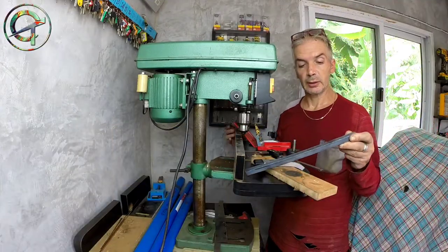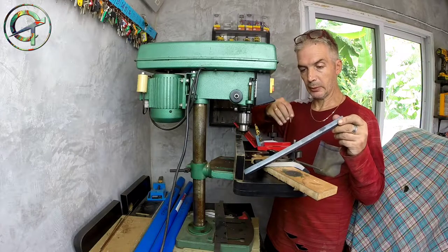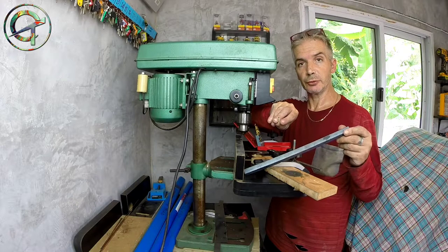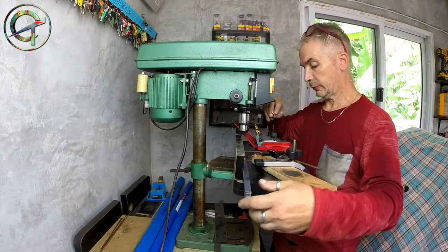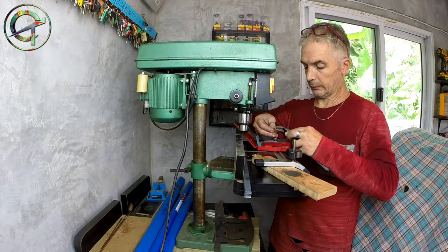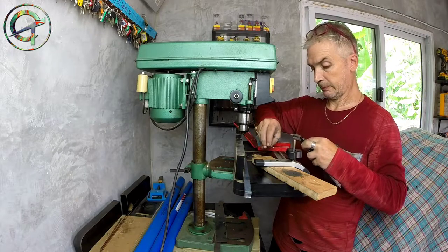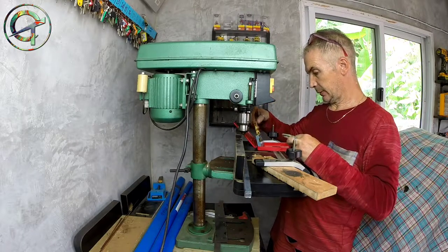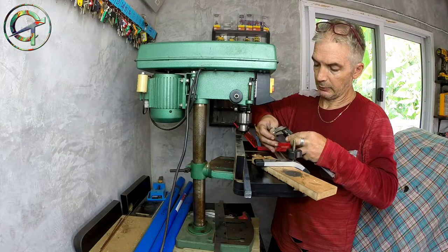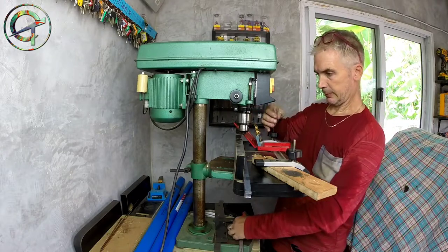I'm here in front of my drill press making holes in the steel inserts that I'm going to use to assemble the two slabs together. I'm going to use screws like this, so let's measure the diameter. Is 3 mm enough? Okay. Choose a proper drill bit, 4 mm. It is okay, a little bit bigger than the screw that I'm going to use.